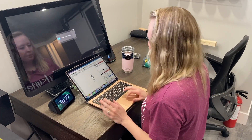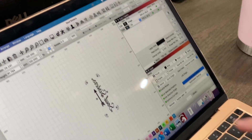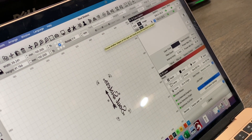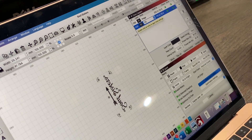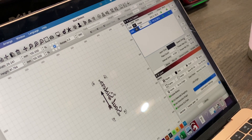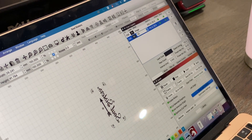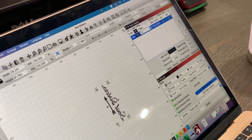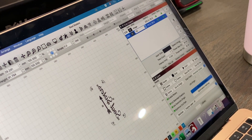So now that we have it centered on the cup, with our image 90 degrees and flipped, on absolute coordinates, moved to center of the laser, we're back on cuts and layers. We want to make sure the fill is set. My settings for Yetis are: speed of 175, power min and max are both at 25, and I put interval at 0.05. That way it gets a finer engraving on the words. I've noticed that if it is 0.1, sometimes I can get lines in the names that aren't actually engraved — so at least with an interval half the size, your engraving should always come out perfect.